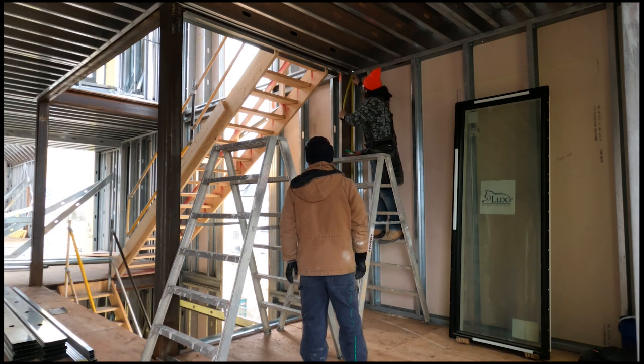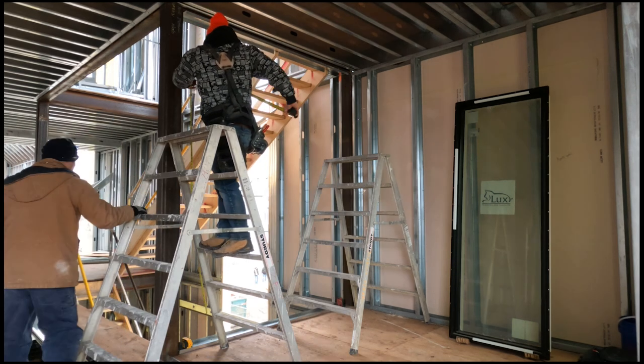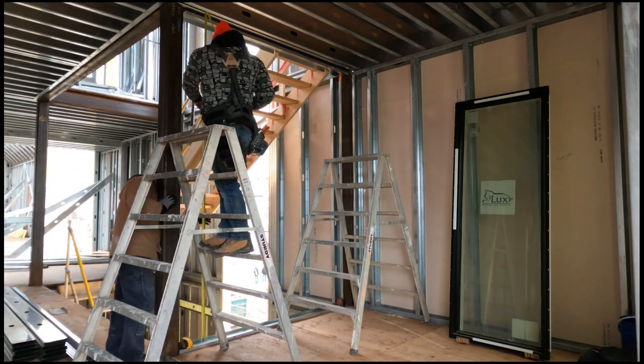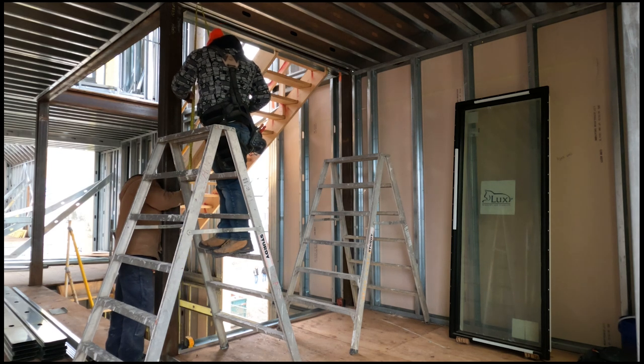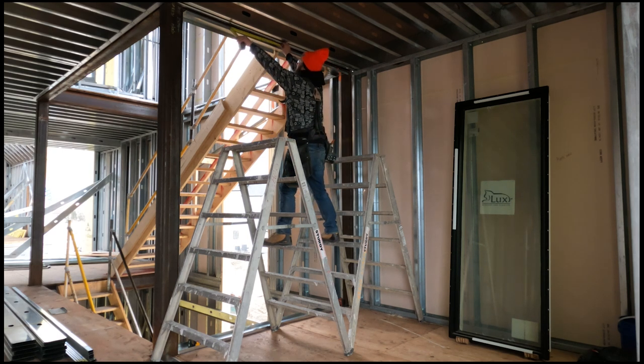While I'm up there I'm measuring both ends because I'm going to cut studs to shoot to the columns. I take note of the height — in standard track we want to stay a quarter inch to three-eighths down from the top. If it's the same, I'll just cut all the studs the same height. You get your stud height and then start marking your centers. In infills you mark your centers and then check your studs.